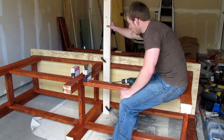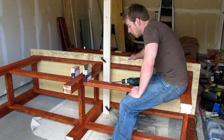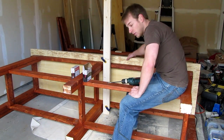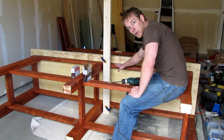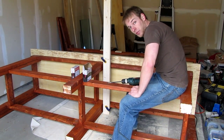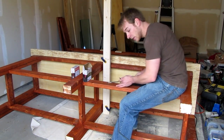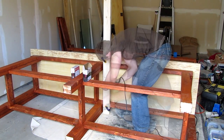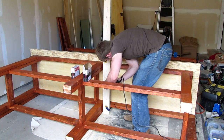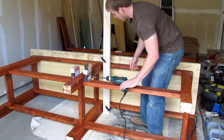I took a 2x4 and 2 Irwin quick grips and attached the top to the 2x4s using the quick grips so that they're nice and tight. And then I'm going to put the screws nearest to the 2x4 on. Then I move the 2x4 elsewhere, keep the plywood firm against the workbench, and continue on. So let's get started. Okay, so 2 screws in. Now let's move the 2x4.